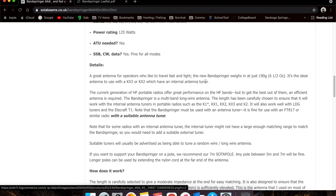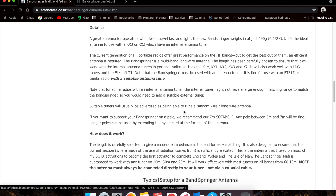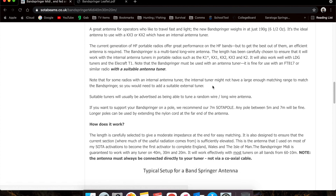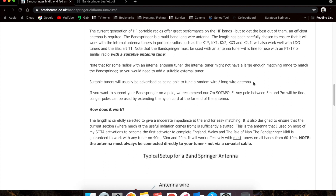It's a light antenna — only about 6.5 ounces. For those who do SOTA, it's a perfect antenna, especially with the KX2 and KX3. You can also use it with an 817 or any radio with a suitable antenna tuner. For our field test, we're going to be using my IC-706 Mark IIG with my LDG Pro 2 tuner — something comparable. It does recommend an external tuner; radios with a 3-to-1 internal tuner typically won't be able to match it.